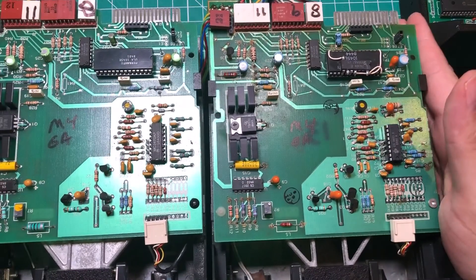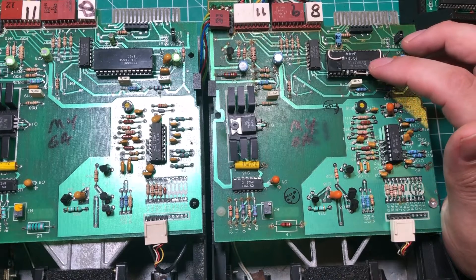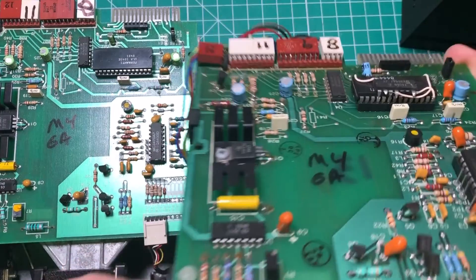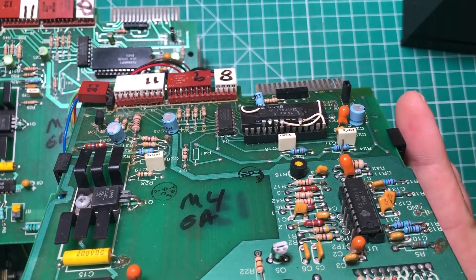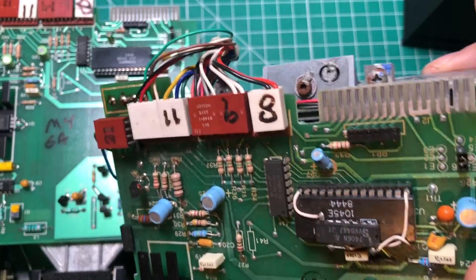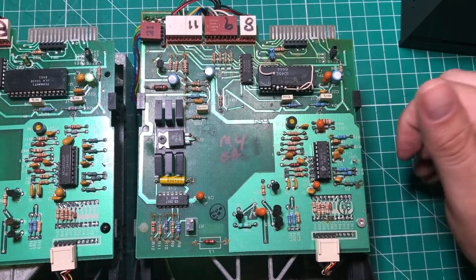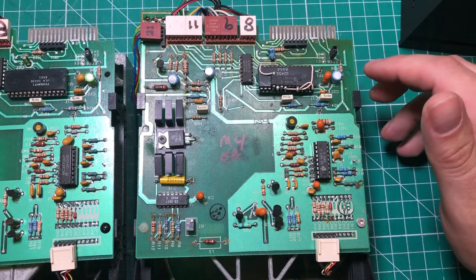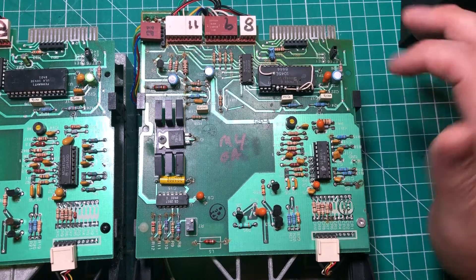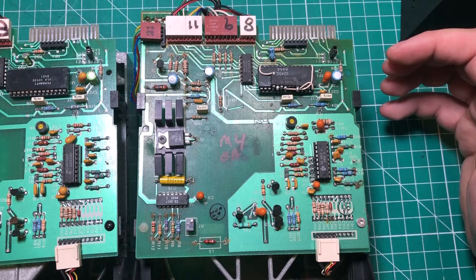Since we're talking floppy drives, I pulled out the original two Model 4 Gate Array floppy drives that I had. I think this is pretty cool — there's a 7406 chip here, and this chip obviously went bad. Somebody actually soldered another chip right on top of that chip. You can see this little bodge wire goes on a pin, skips a pin, goes over another pin and solders in — you can just see the way they bodged it on there. Back in the day this drive was expensive — a substantial portion of someone's income. Where today we would just throw something like this out, there were real technicians doing real things to save it with 30 cents in parts. That's just part of computer history.